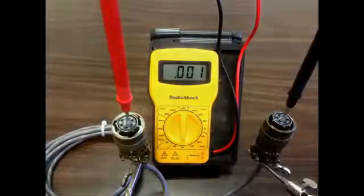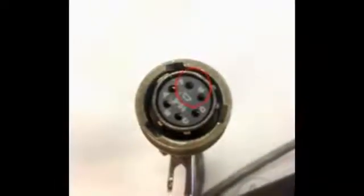There are only four wires in this cable. Pins E and F are not connected, so these readings should be open circuit.